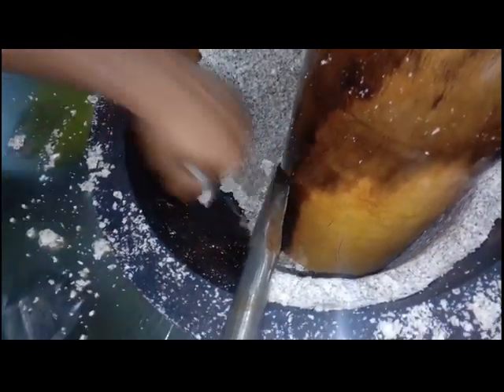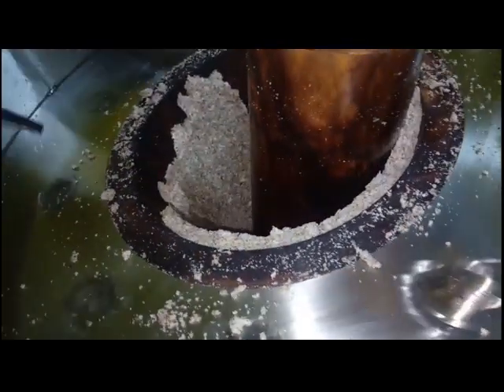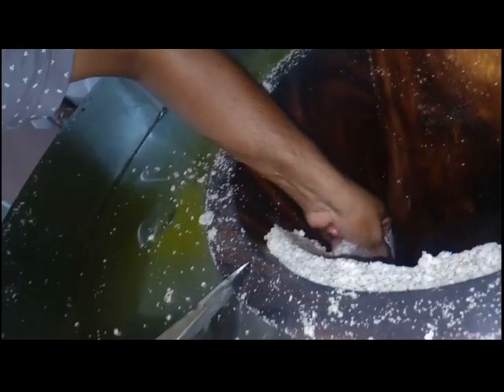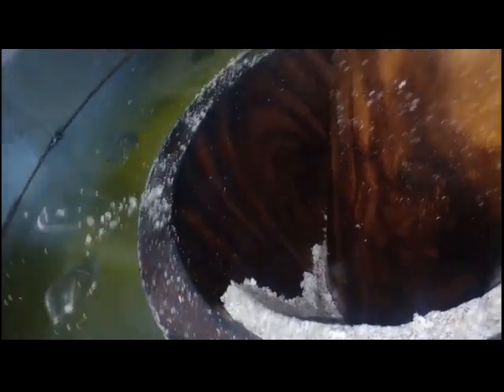Now you can see that the inner area will be fully wooden. It is called a cold press — when you are processing, there will be less friction between the two wooden parts. The RPM is very less, around 14 RPM, so heat will not be generated when you are extracting the oil.